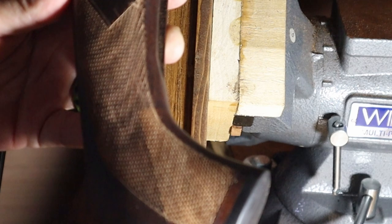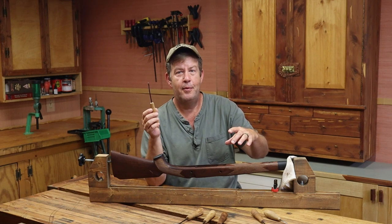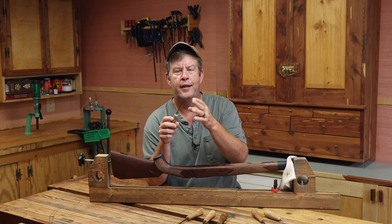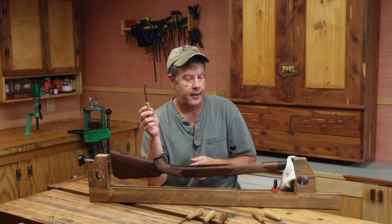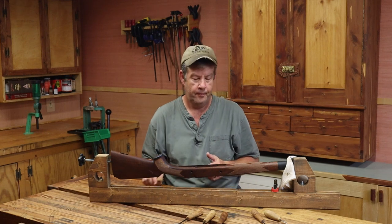And this is going to be our finished cut, and the bulk of the pattern. And it's going to get rid of a lot of imperfections also that are in there. It's going to give us really nice, clean, sharp points. This is a fine cut, whereas the 60-degree cutter is a rough cut. And it's just going to clean things up and just give us a nice surface. We just need those deeper lines to work with.